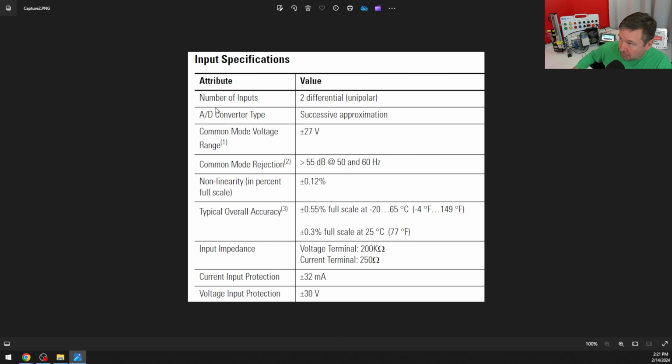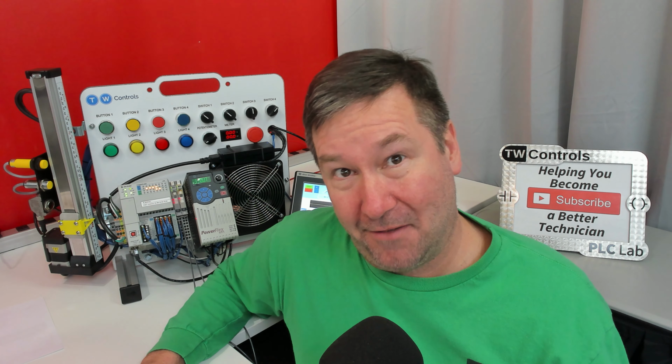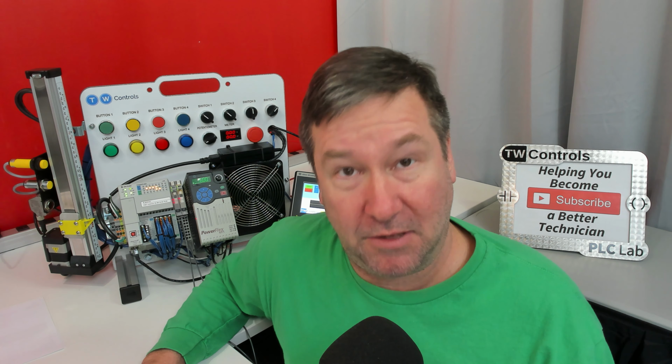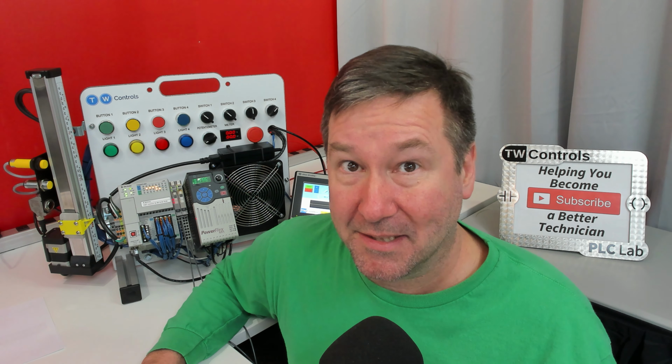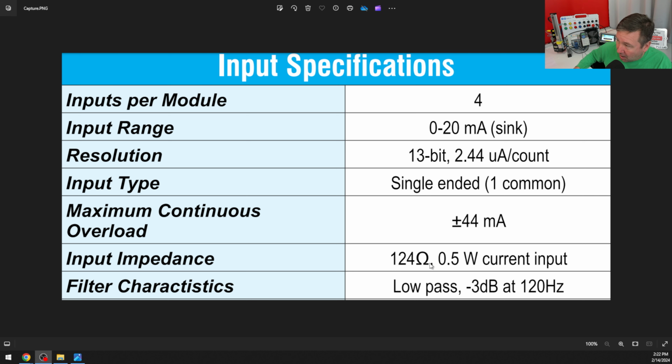Let's talk through this with two very common input specifications for a 4 to 20 milliamp signal. Neither of these is the one I warned you that if you do it, you will absolutely burn up your analog input immediately, but the specifications do tell us we can't do it. On this one, it says we have 124 ohms, but we can only handle a half a watt.